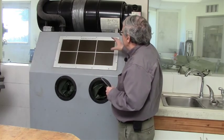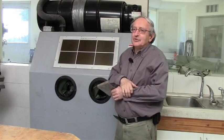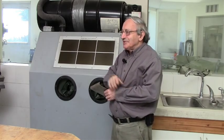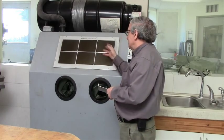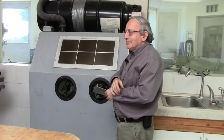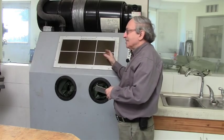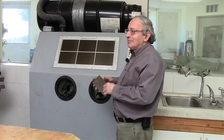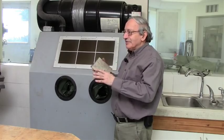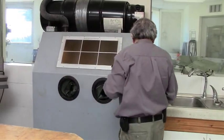So it's a lot of maintenance to constantly replace the protective plastic. Now you can buy these glass panels which are diamond coated, and they are used for supermarket scanner checkouts so they don't scratch from the product, and they cost about maybe 20 bucks each, but they last a lifetime. So I had this here for many years and they are as good as new. And it's important to be able to see what you're doing when you sandblast, to make sure everything is cleaned up.